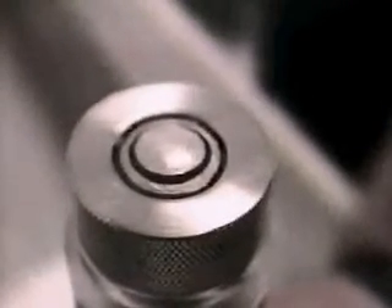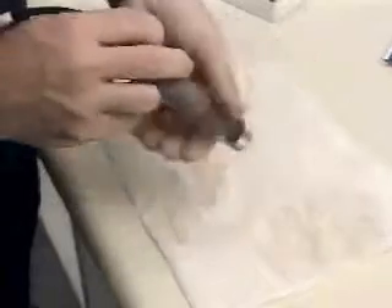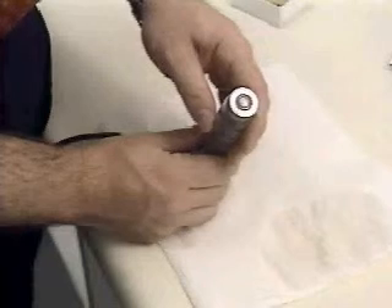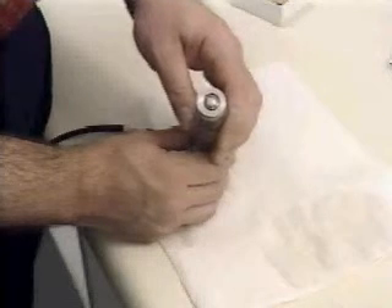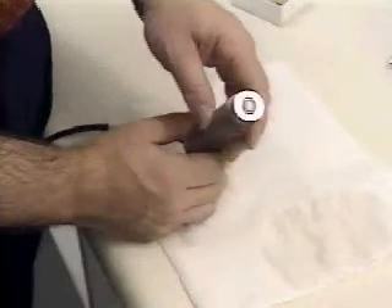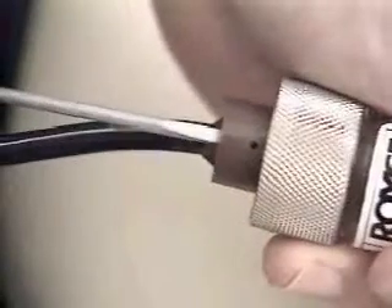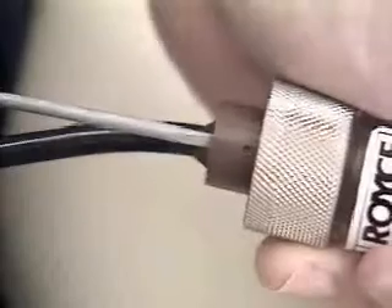Inspect the surface of the membrane. It should be perfectly smooth and free of all wrinkles. To check the membrane for pinhole size leaks, first dab the membrane dry with a paper towel. Next, wrap the sides of the sensor with your hand a few times. Now check the membrane again. If droplets of electrolyte have appeared, you may have a pinhole leak. If so, you must reassemble the sensor to install a new membrane. As the final step of the sensor assembly, tighten the vent screw. Do not over-tighten the screw. It is only necessary to bring it down until it makes contact internally.